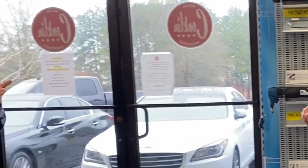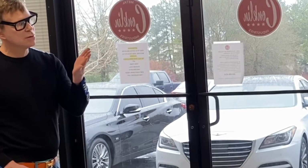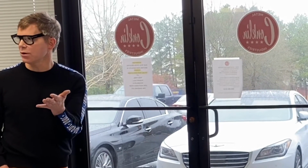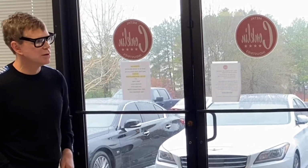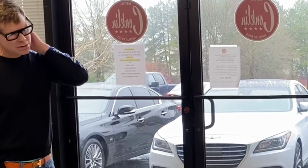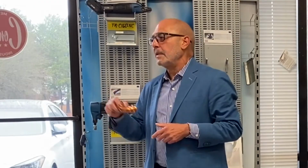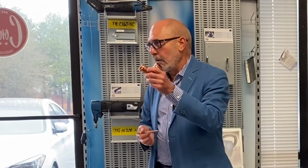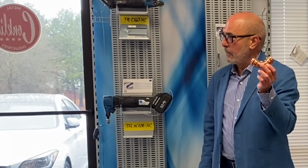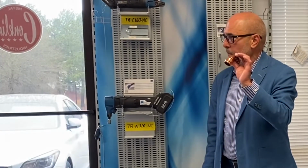Press fittings were introduced as an alternative to the way that most contractors still do it, right? Welding, soldering on the site, right? Contractors never heard of a press fitting. What are the advantages? No fire permit. If it's a mechanical contractor, they are using this fitting right now for chilled water applications. So they know that the press systems work.